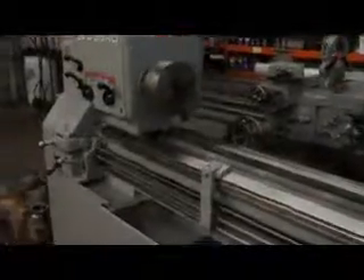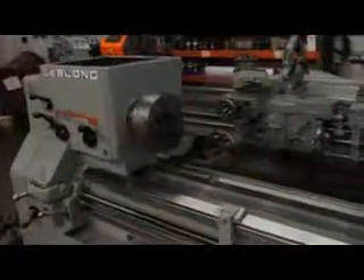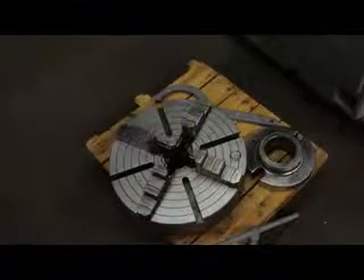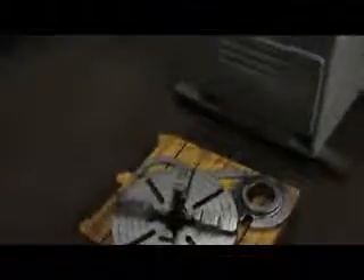In conclusion, we have a 9,000-pound overall weight. The machine can either be wired for 220 or 440 — it's three-phase, and it's currently running at 220. Here is your beautiful heavy-duty 18-inch four-jaw Cushman chuck with one-piece top jaws, as well as an L2 direct-mount drive plate. The machine is also equipped with an inch and three-quarter bore on the spindle. It has a number four Morse taper in the tailstock.